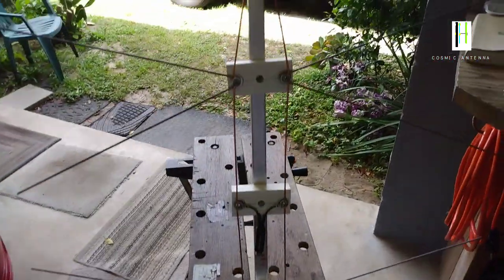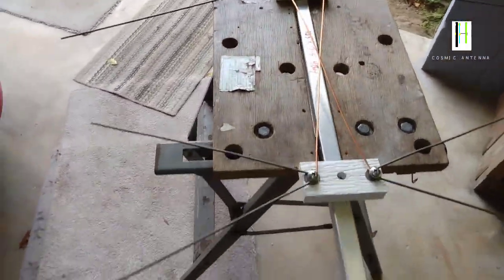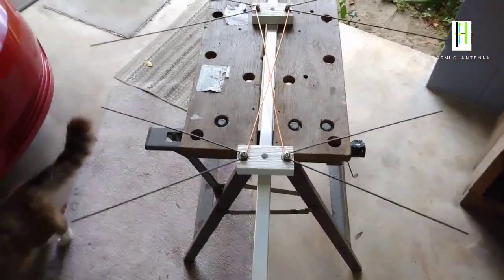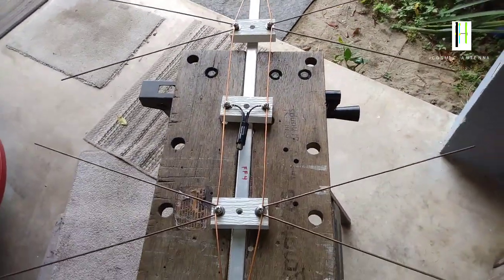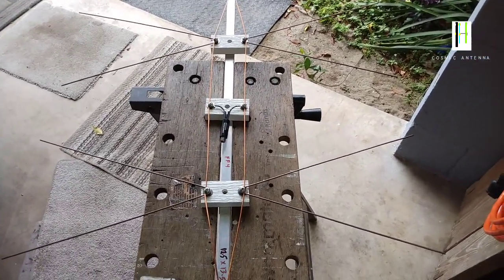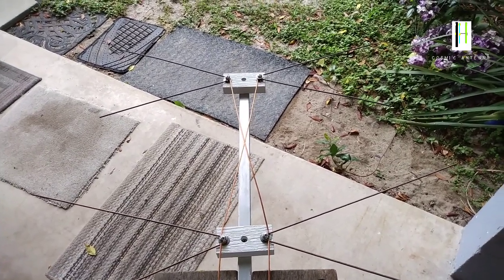What I don't need here — I mentioned this is more antenna than I need — are these top and bottom bows that are nine and a half inches. I don't have any channels that fit that wavelength. My channels are 16, 19, 21, and 31. That's perfect for the 12-inch bows. All those channels fit beautifully on these 12.5-inch bows. They don't fit the nine and a half — that's for a smaller wavelength.